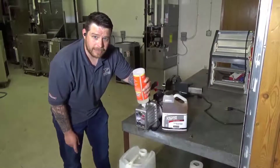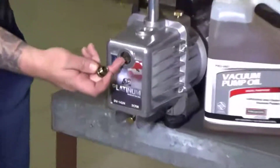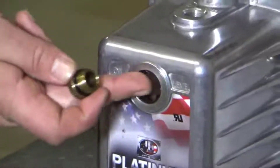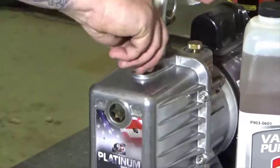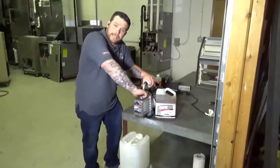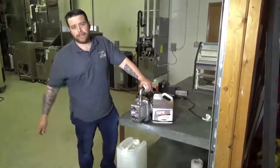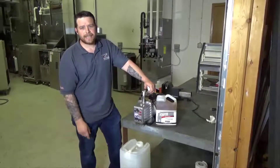We're good to go for the next evacuation. Our oil level is full — you can see the sight glass is halfway full. Go ahead and take your oil fill cap, put it back on, and make sure you secure it down tightly but not too tightly. Don't use channel locks to tighten this up because you'll never be able to get it off again. That's your vacuum pump tips — thanks, and we'll see you at TSI.